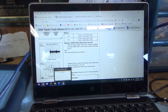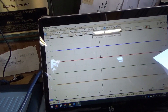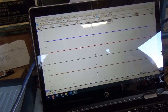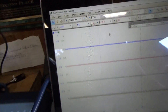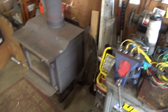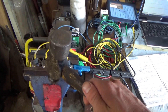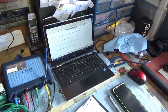How do we set up the scope for this? Let's do 20 volts per channel and half a second per division — 500 milliseconds per division. They're ready to go. As soon as the sensor feels a vibration, it'll send a signal. The piezo crystal will actually produce a voltage. I'm going to knock the vise with a hammer and then we'll see if we get a signal on the scope.